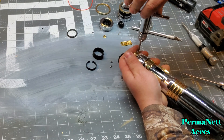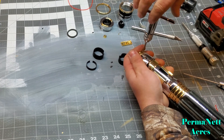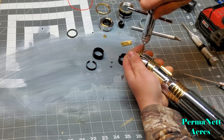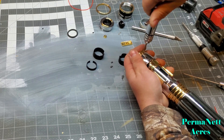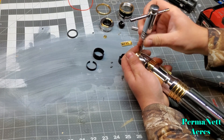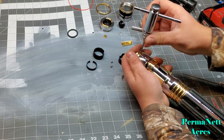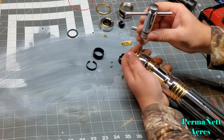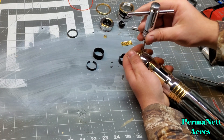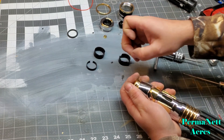This has already gone all the way through. Just going to finish working this all the way down and then reverse it. You could do this with a drill, but you're more likely to end up stripping your threads using a drill to tap it out. One of the best ways of tapping is using a lathe.